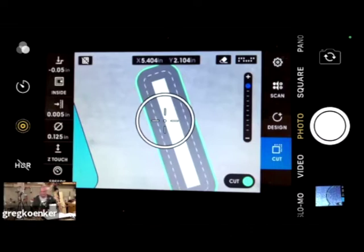Then I follow it up with, maybe on the last pass, to save myself one, I could either do all 3 of them and get my 3/4 of an inch depth, or I could do 2 of them. And then on the 3rd pass, I'm going to tell it 0 offset. So now it's going to go that 5/1000ths closer to where it's supposed to be and clean up any discrepancy at all. So it ends up giving you a really, really nice cut.